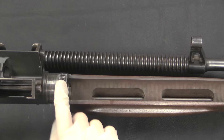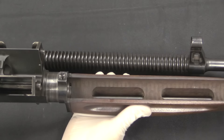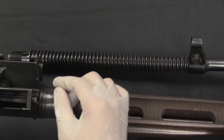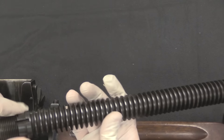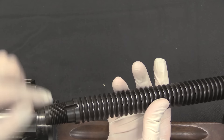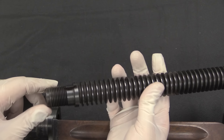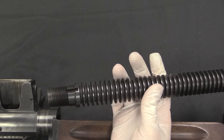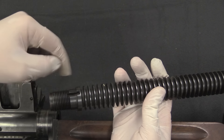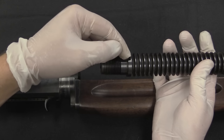The literature describes this gun as having a quick-change barrel, which is sort of correct — it does have a changeable barrel. There is a screw on the front of the receiver that unthreads, and when it does it comes out of a slot in the barrel. Once this screw is free of the slot you can unthread the barrel. You can't just push a button and pop the barrel out — it takes a bit of a procedure, but it is an easily changeable barrel. Because of this locking screw, you don't actually have to have the barrel threads tightened way down; this prevents it from unthreading.